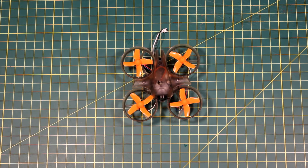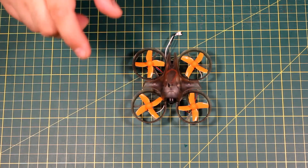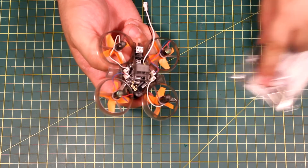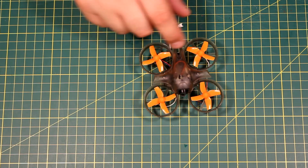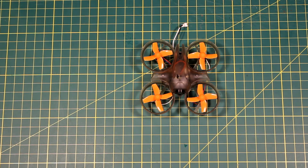Through the power of video editing, this is now done. I've swapped the motors around — just flipped the pairs — which now means color-wise they're in the opposite direction to how the original motors were. The props on the other hand are still in exactly the same direction — still reverse direction. I've actually already tested it and I know this now hovers. So all I'm going to do is rig the camera back up and demo hovering.